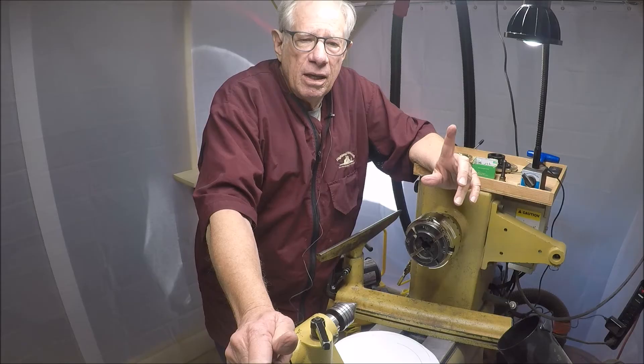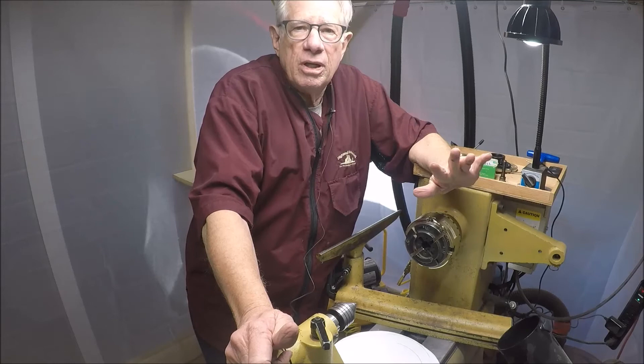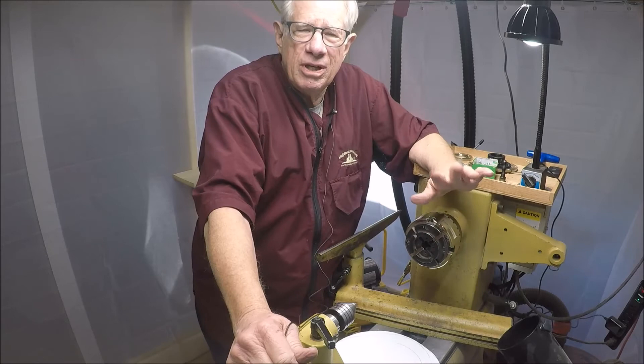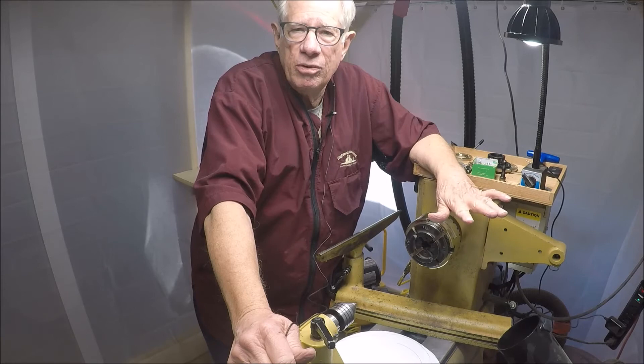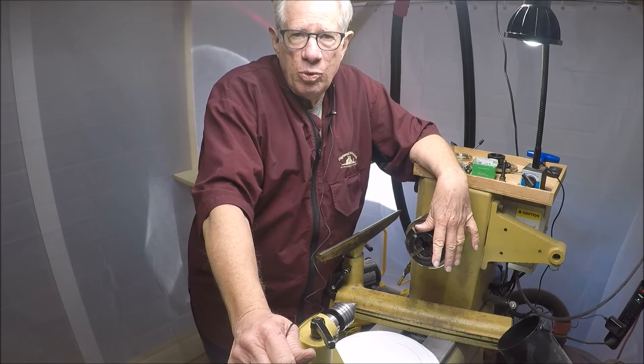If you turn green wood — and most of us do that when we get free wood — it's going to do two things: it's going to warp on you, and it may split on you. So you've got to learn how to deal with green wood. There are other videos on YouTube that will teach you how, and there are different methods — get one that works for you. You can develop a pipeline of wood to be turned. Sometimes it takes six months to dry out a good chunk of wood, so you need to have a kind of pipeline of wood coming to you.